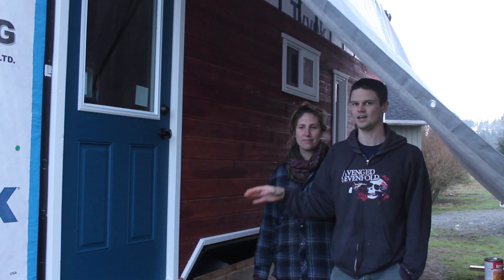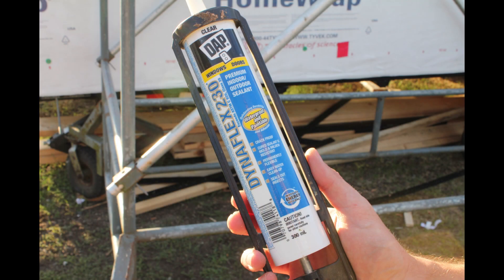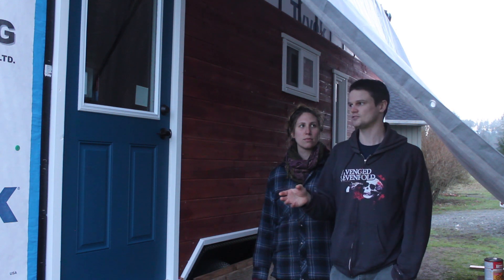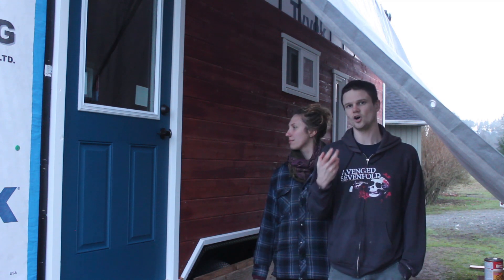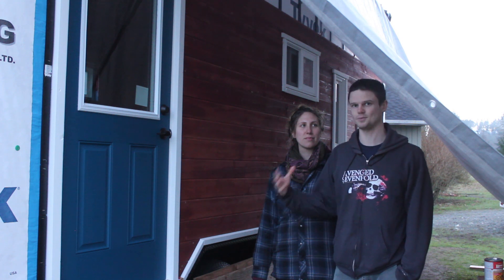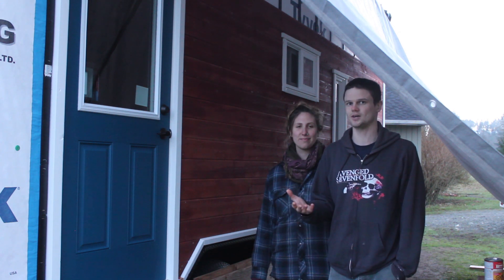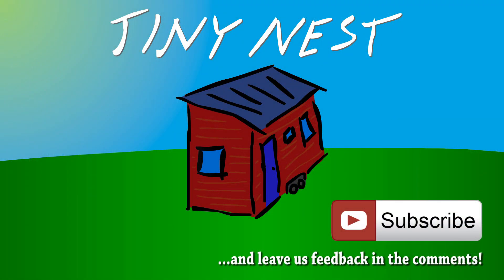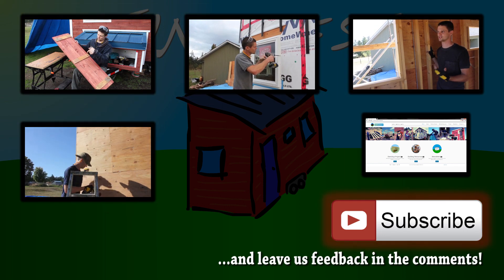The other lesson is about caulking — as you saw when we pulled out the old door there was all that unset caulking. We started with a water-based caulking which was fine initially in the summer, but as soon as the weather got a bit colder and damper that stuff just would not cure and we actually had it rinsing away in rain. We switched to a different brand — an all-weather type that's much thicker and works way better — and that's what we used everywhere on the door under the paint. We never thought to research different types of caulking, so that's another point worth considering. If you want to see some of our previous videos click on the preview tiles, and subscribe if you want to follow our progress — you can also visit our website.